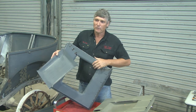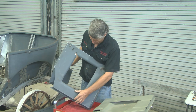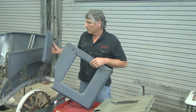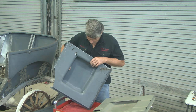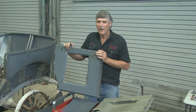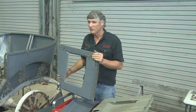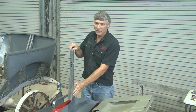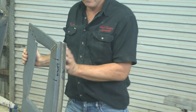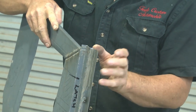The door pocket is well on its way. I've wheeled up this section here because comparing it to the front door there's quite a bit of dish in it both ways, so I've done the same with my replacement panel. I've got these edges rolled in and I've made a little checking strip of metal cut to this profile so I can check the depth and curves as I go. This piece here still needs some more work — I've got to roll the edges up a bit more, then it'll be trimmed to fit into the door and I'll do a butt weld all the way around. At one stage I was feeling very happy thinking I was on the money for all these angles, but there's a bit of a twist across the door and that changes everything. So I made the first one, got all this section formed — it's got a zigzag in it through there — and I've done that with two pieces of metal again.